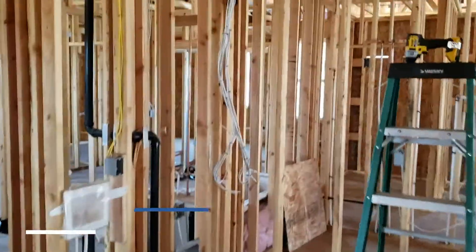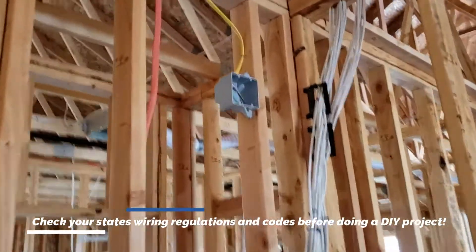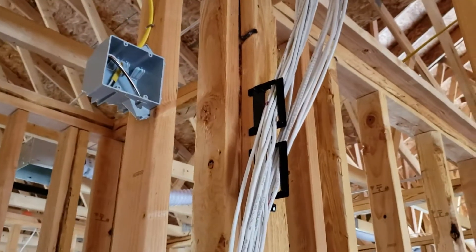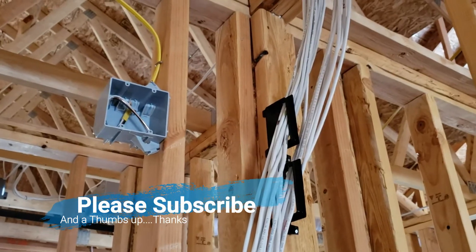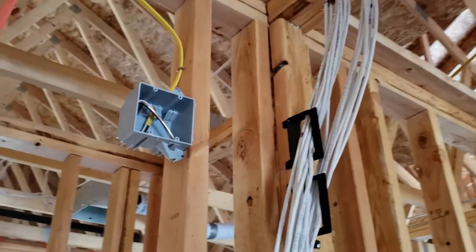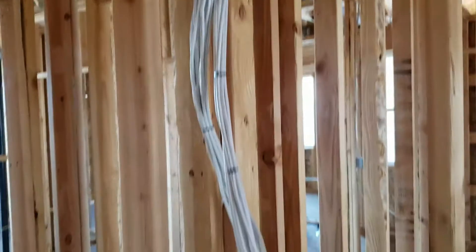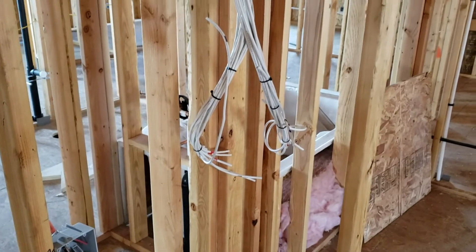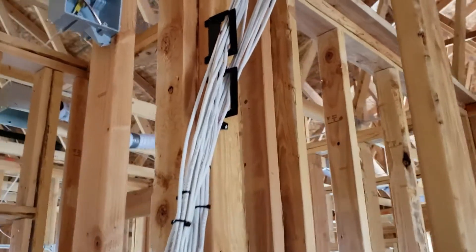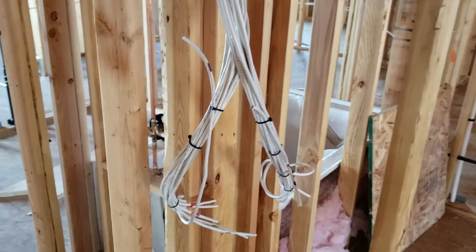This is the equipment room — they've got a washer and dryer, cabinets going up here, and we're going to have electrical and all the cables to the entire house. I have a few more rooms I haven't shown you yet that I'm running. I recommend three Cat6 and one coax cable to each room. These outlets are all going to be inside the cabinet, and I left plenty of space. It's always easier to go longer than too short.